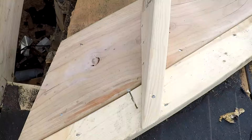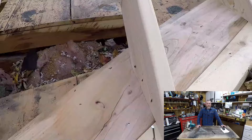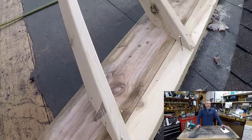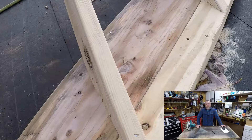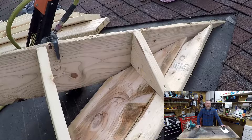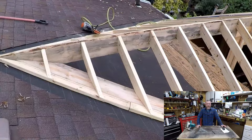My valley board is a 2x4, and I had to add a 2x10 to catch the heel of the valley rafters, because the heel is where all the weight comes down. I'll show you how to get the valley board in. Where I'm at, you can't just sit on the roof decking anymore — used to be able to, which made life easier. So you've got to put a valley board in and catch the heel of the valley rafters. You can see how it comes to a point right at the end — that's how you keep it all in plane.